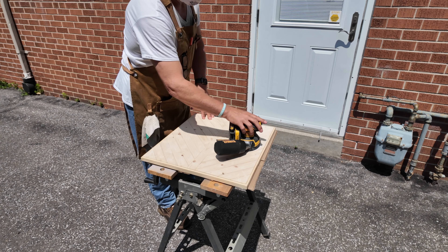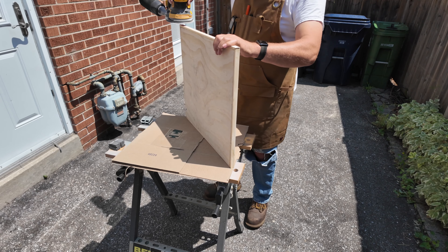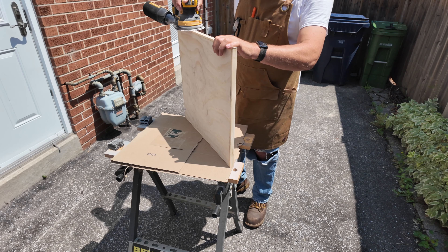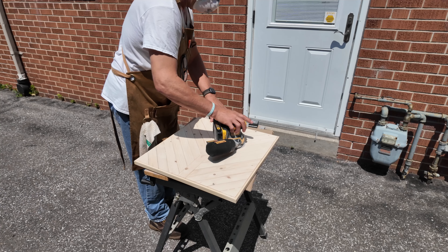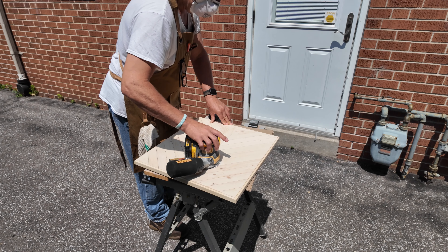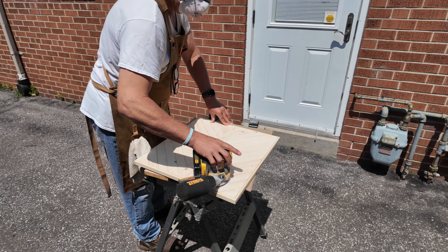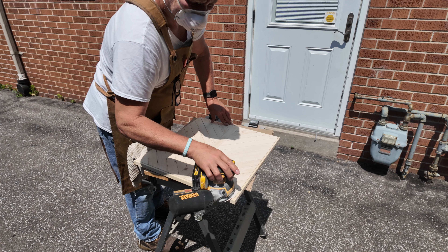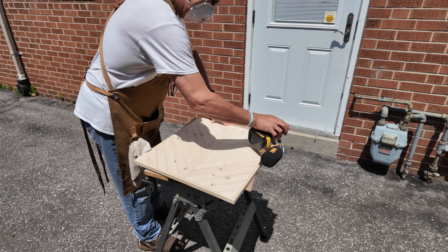This is an important step in the process — this final sanding with a higher-grade or finer sandpaper. I need to make sure that the face of my pine is level and square, because in this particular case I'll be putting acrylic glued directly onto the pine, and you don't want too many high spots or low spots because then the acrylic is not going to sit flush on top. So I bring out the square and check from time to time to make sure I've taken all the high spots out and have a nice flat level surface so I can later glue my acrylic to it.